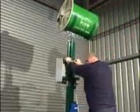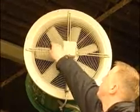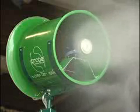Once installed, the Probe atomiser requires very little maintenance. Other than refilling the Aironaut and ProSorb tank, it's simply necessary to brush the fan guard once a month to remove any debris. The atomiser itself will be maintenance-free. There are no filters to change, and the atomiser head never blocks.